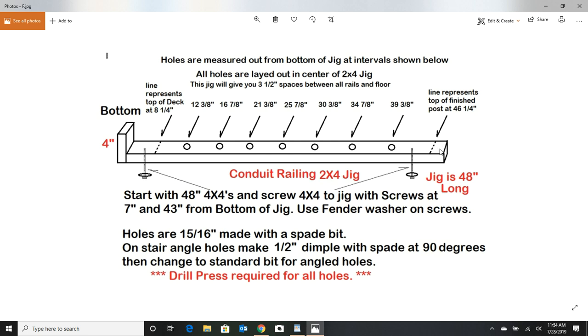I highly recommend: do not cut all your 4x4s to size. Get them all up, get them installed, then use a chalk line to make your marks and cut them to size when you're ready to put the railings on top. In my case, I laid a 2x4 on the side of the 4x4s vertically, and then horizontally I've got a 2x6 to cap it — you can look at the pictures for that. Also, drill some pilot holes first with a couple of 3-inch screws so they go in and out easy and really suck the wood in tight.